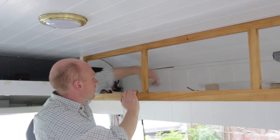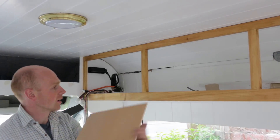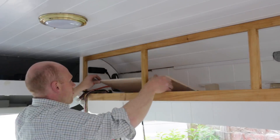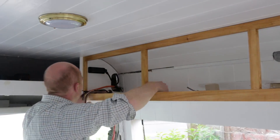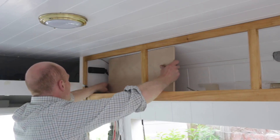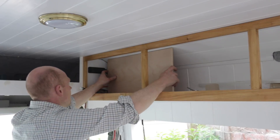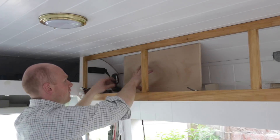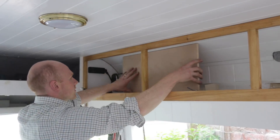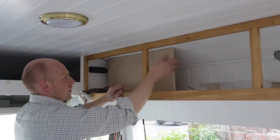I wanted to build a false back here that will tidy up all the wiring behind but also give something much stronger to hang onto. This is only six mil ply in the base so I'm just going to put a strengthening piece in there — I've cut a piece of 12 mil which will become our wall. I should have painted this white but I've run out of time. It'll be fixed with some blocks, and the idea is there'll be a little bit of slack on the cables behind, I can fix the unit to here, get to any cables, and then just slide it in and put our fixings in.